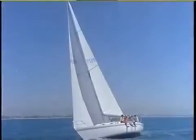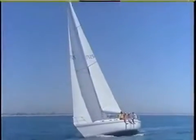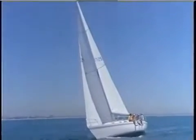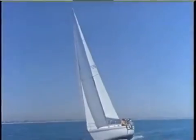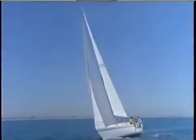When the backstay is eased, the headstay sags, and as a result, the sail becomes fuller. Sailing with a relatively loose backstay is often desirable in order to make the Genoa deep for light air. On the other hand, a very tight backstay reduces sag and flattens the Genoa for stronger winds or very smooth water conditions like these. A skilled sail trimmer adjusts the headstay sag and halyard tension together.